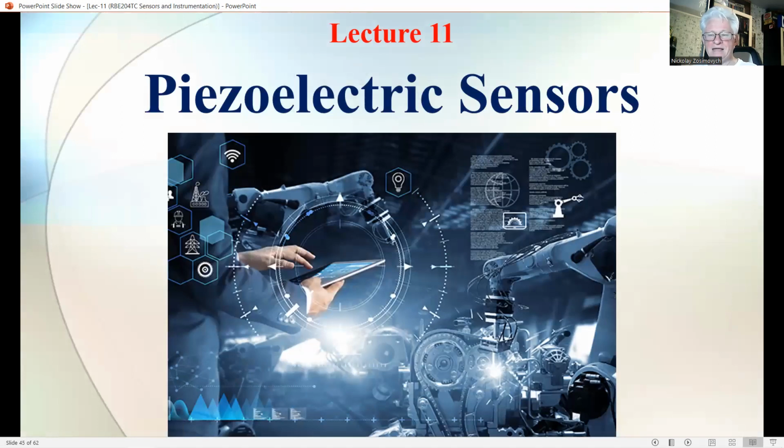And now we will start to study another interesting topic called piezoelectric sensors. In this part of our lecture, we discuss principles, properties, and applications of piezoelectric sensors. A description of the piezoelectric effect is followed by an overview of the most common piezoelectric parameters. Piezoelectric materials are used in force sensors and accelerometers, the subject of the second section. Interface circuits for piezoelectric sensors are treated next, and various specific and original applications, including tactile sensors, are listed in the last section of this part of the lecture.